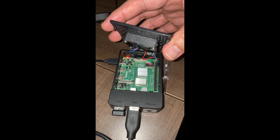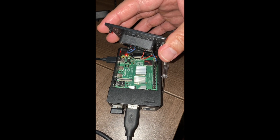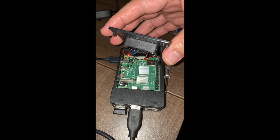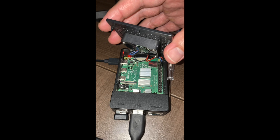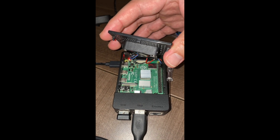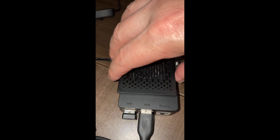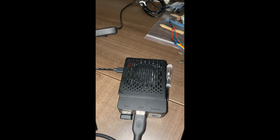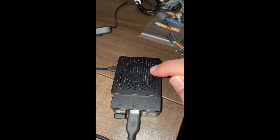If you use your Pi in your office or house, that won't be an issue. But if it's deployed in the field on a UAS — unmanned aerial system — or unmanned ground system, or in an industrial setting, it gets pretty hot. So it helps to have additional cooling besides the heat sink. Keep in mind that the Raspberry Pi OS is configured so that if the temperature reaches around 85 degrees Celsius, it will throttle down to prevent damage. In that situation, having a fan would help.